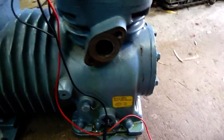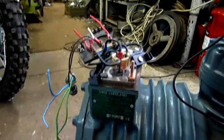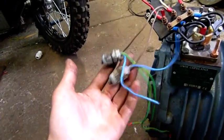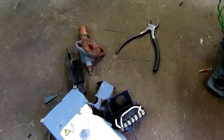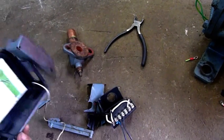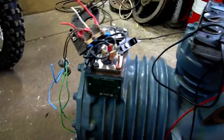The oil is well used with a nice yellow tinge to it, but I've seen perfectly good operable compressors with the same colored oil. It's also dual voltage so I can run this on 240 volts. I'm pretty sure they've been running it on 240 because they're tapping their fans straight off it. It was probably running off a VFD. The control box for the condenser was gone — there was a pressure control on there but its copper lines had been chopped off. Funny thing is they ripped all the copper out for scrap but didn't bother collecting the coil, just threw it in the steel pile.